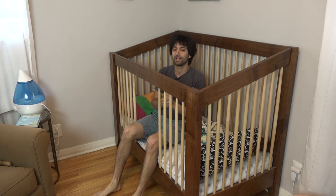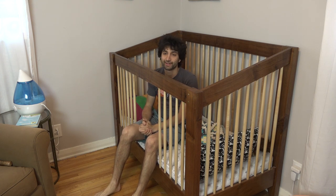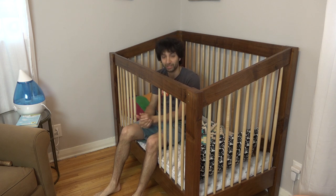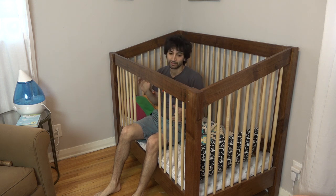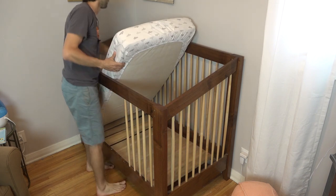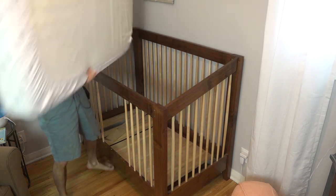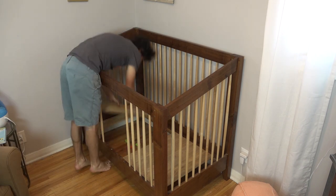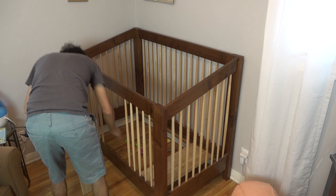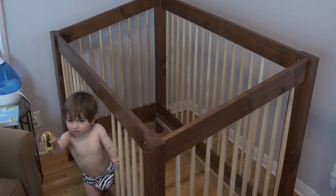The missing spindles have a little story. When I built the crib, I heard from people who woke up in the night to their child with legs or arms stuck between spindles and had to pull the spindles out to free them, essentially breaking the crib. So I made these spindles slightly shorter so they'd drop to the bottom hole with only about an eighth of an inch in the top. In a panic, pulling a spindle would flex it enough to just pop right out. Well, when my son got old enough, he realized he was strong enough to pull a spindle out himself.